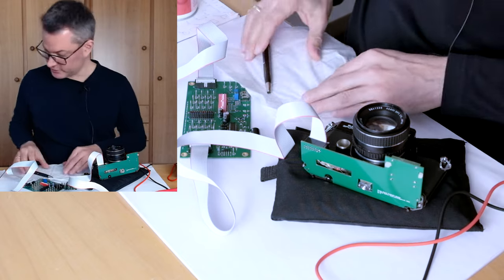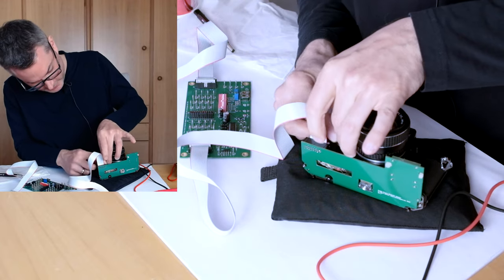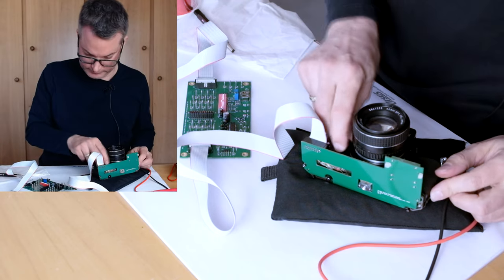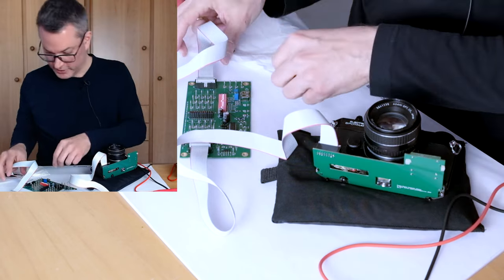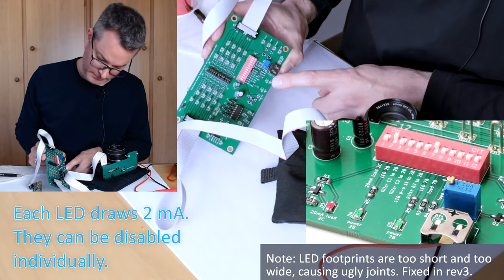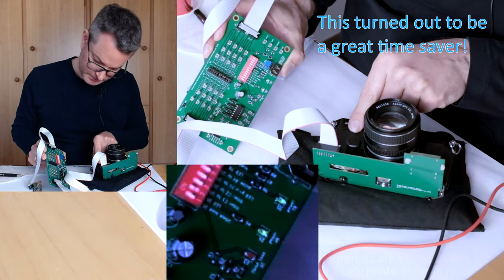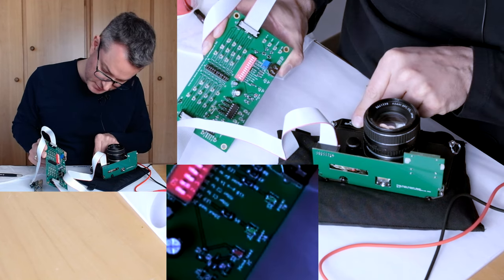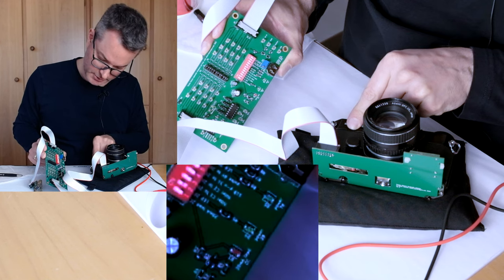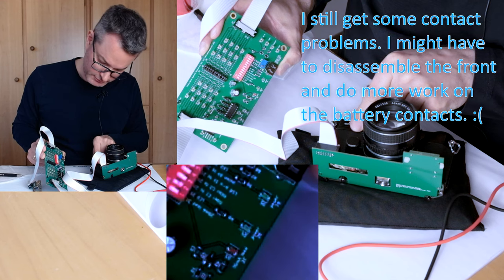Hopefully that cleans up the contact spring and makes it work more reliably. That looks better. My board has power LEDs for testing two of the power rails in the camera. When the camera is in automatic and I depress the shutter release I now see that these power rails are powered, which was not working reliably before. So hopefully the contact has improved enough.